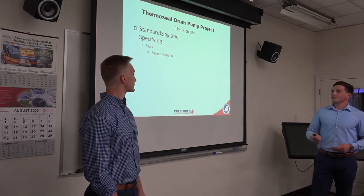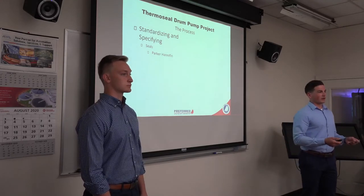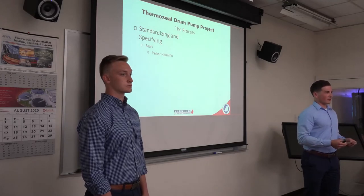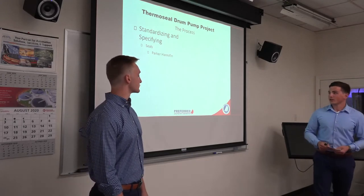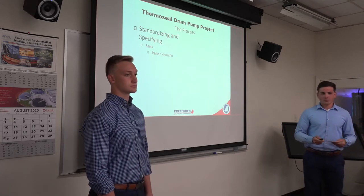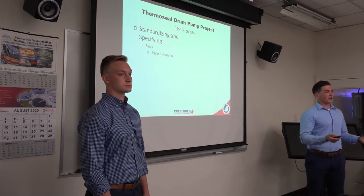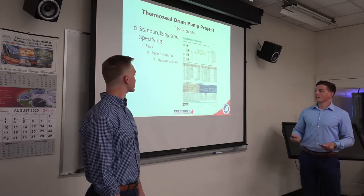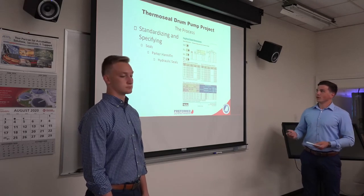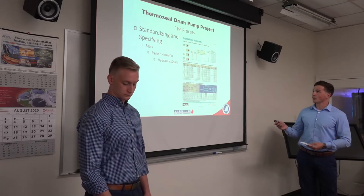We decided to go with one manufacturer primarily for our different seals. Whether that be for the hydraulic fluid seals or for the O-ring seals, we chose Parker Hannifin as our manufacturer, because in case we had any conflicting dimensions, using the same manufacturer should keep things consistent across the board. Here's an example of one of the spec sheets that we referenced for a hydraulic seal. This is a Poly-Pak.